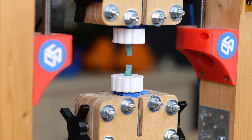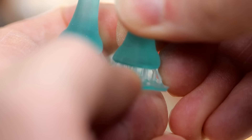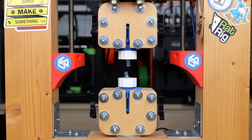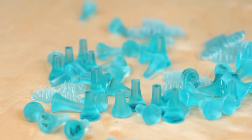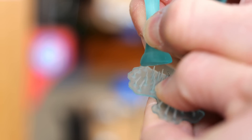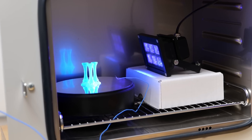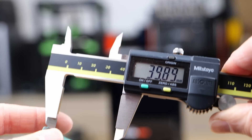Then it became really interesting. The samples cured at 40°C failed on average at 56 MPa, which is almost as much as the maximum strength we got on the CW1S at maximum temperatures. The 65°C coupons were already subjectively harder to remove from the supports, which also showed in the results — these samples were a third stronger than the ones cured at ambient temperatures, failing at 64 MPa on average. Even the fracture surfaces started looking differently; whereas previous samples were all flat, these parts now had a bit of a rugged surface. I couldn't measure any real warping on my parts at the highest post-curing temperature and they became hard again once they cooled down.